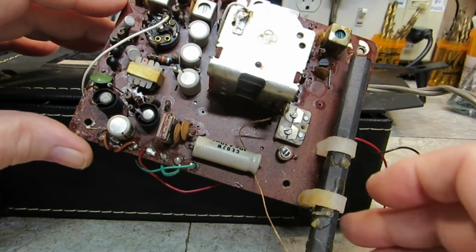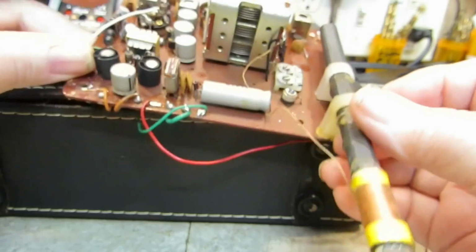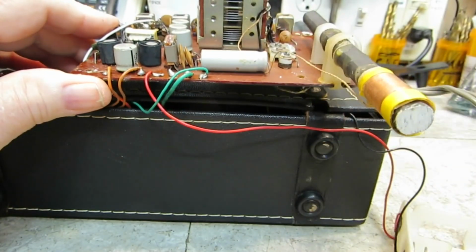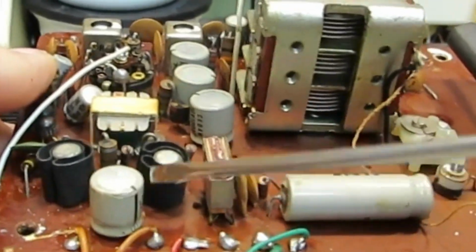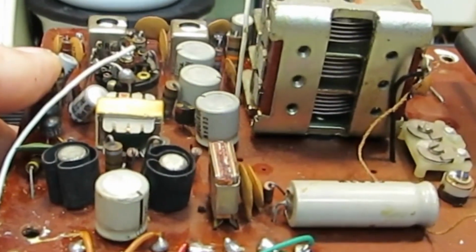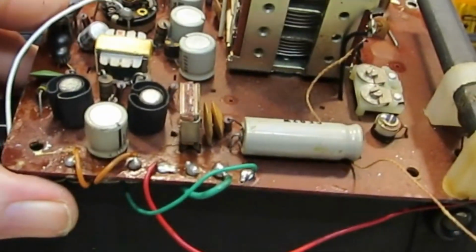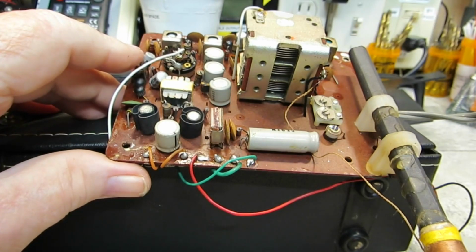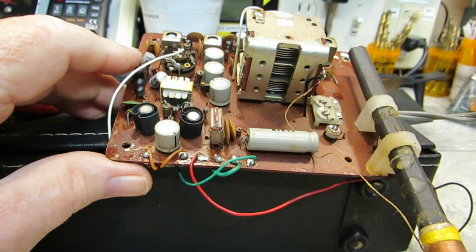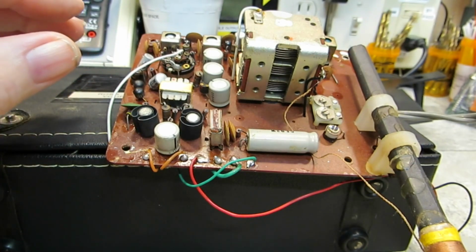It's got 4 leads on it, so you can't hardly see it, but I can't get to it to see it. As you can see, there's 2 leads there. I think you can see, right? One there, and then there's one on the back corner as well. So there is 4 leads coming off of it. And again, like I say, one side measures normal like a diode. The other side measures the same both ways. So that's usually a good indication that one side is shorted, and that would cause the problem, obviously.